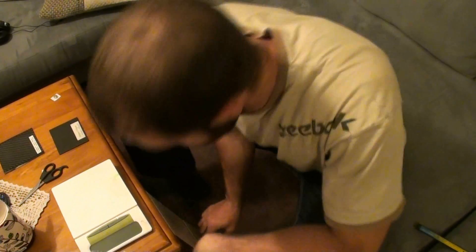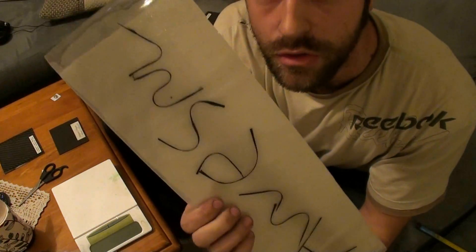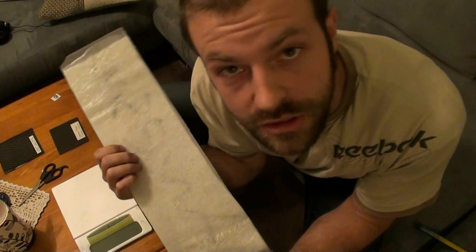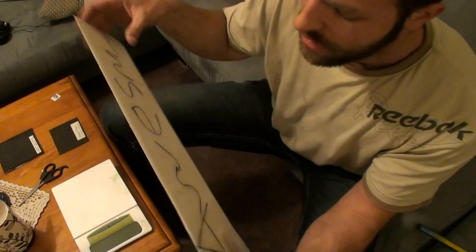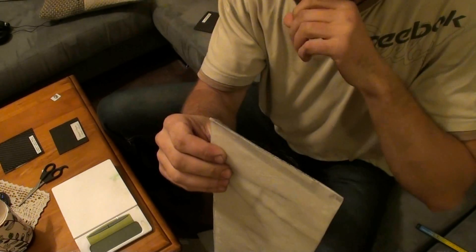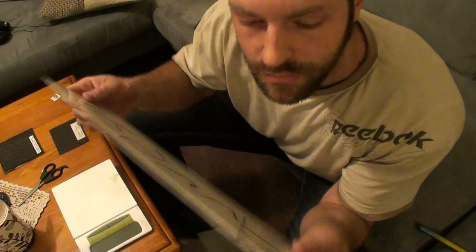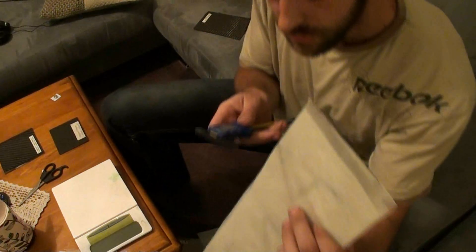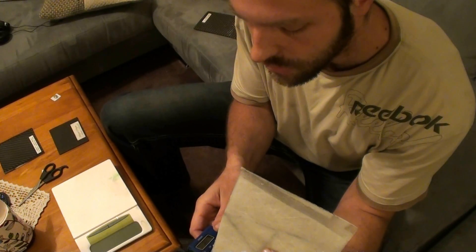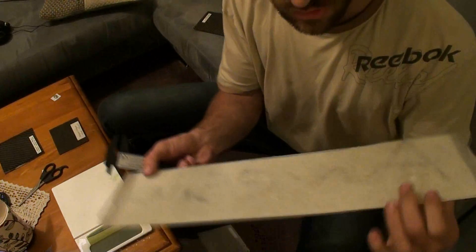Now I've got a couple of fiberglass sheets to show. This one is a single sheet of 450 gram per square meter fiberglass, brushed on. It's pretty flexible even across the width. But it's very thick — measuring at several points: 2.4mm, 2.9mm, 2.6mm, 2.1mm. It varies because it's just brushed on — you can see the high and low spots in the surface reflection.